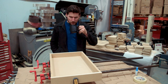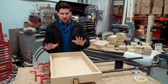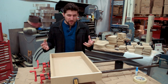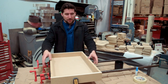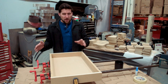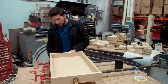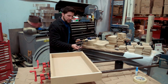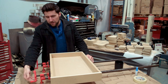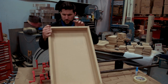That looks like it's going to work just fine. The key here was to get the two sides nice and even, perfectly level, flush with the bottom — which is why I had them resting on these pipe clamps. That was important to ensure a nice flat surface along the bottom since these are cut to the exact same height. The other pieces are just here for stability, to make sure everything stays square and held together well. They're not going to help guide the actual router. I glued this up at about 10 o'clock last night and it's around 2 p.m. now — everything should be good to go, nice and sturdy.